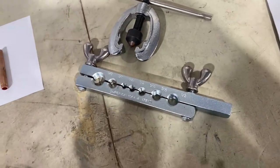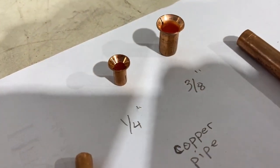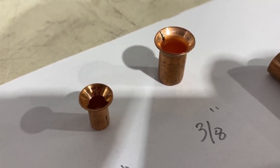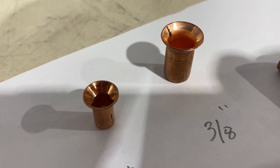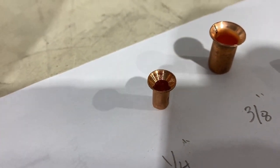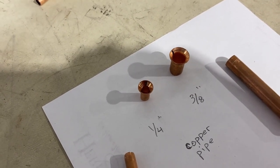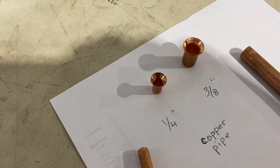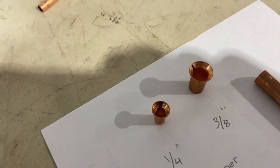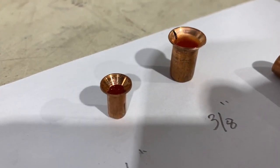I've got a couple of pieces of tubing to show you how they work. The two that are already flared are our baseline — I cut these off the actual tubing that I want to copy the flare to. The reason I did this was the tubing was 16 feet long and I only needed 8 feet, so I had to cut it, and I needed to produce a new flare. These are 45-degree flares. Depending on what you're doing, you may need a 45 or possibly a 37, so research whatever you're working with to determine if you need a 45-degree, a 37-degree, a double flare for high-pressure brake lines, or a single flare such as this. This quarter inch and 3/8 inch show the standard — that's what I'm aiming for.